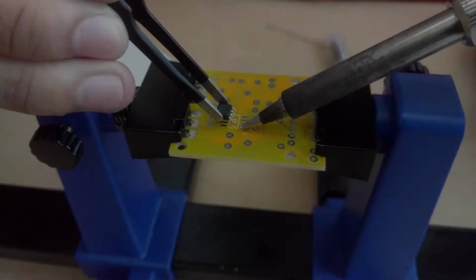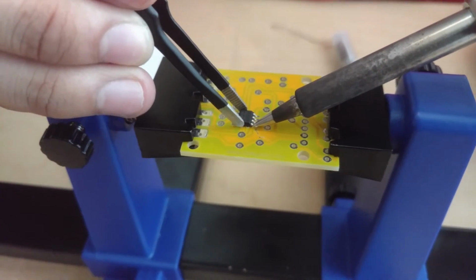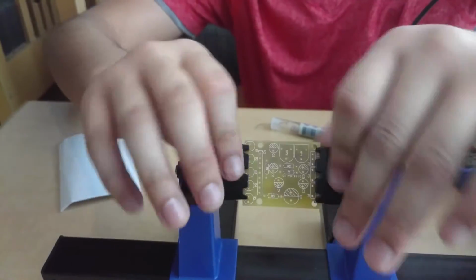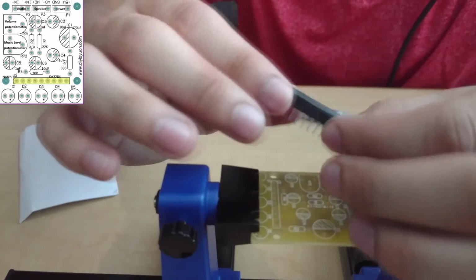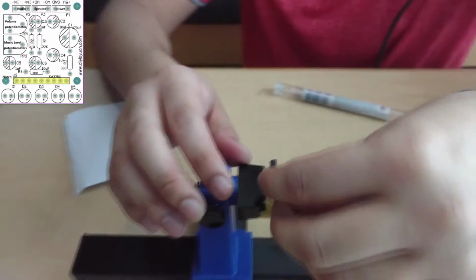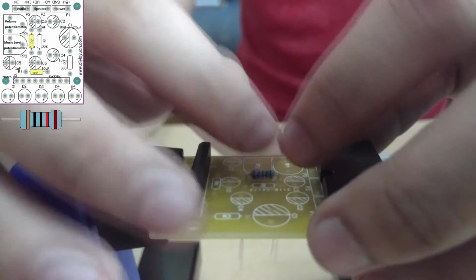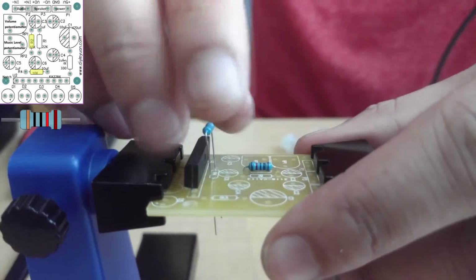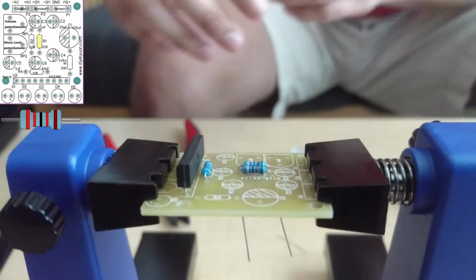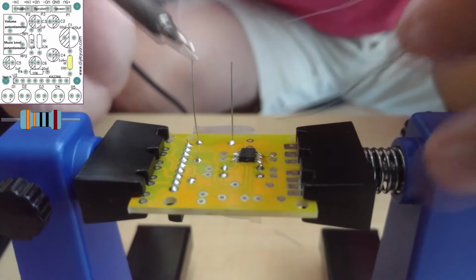And so we start the assembly of the circuit board with the integrated circuits. Solder the power amplifier integrated circuit on the back of the circuit board at U1. Then flip the board over and solder the KA2284 voltage level indicator at U2. Now take out the resistors and solder the 10K ohm resistors at R2 and R4. Then solder the 22K ohm resistor at R1. Finally, solder the 330 ohm resistor at R3.